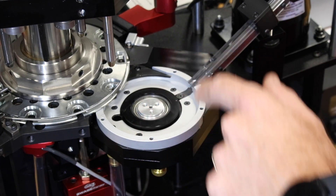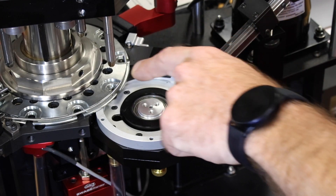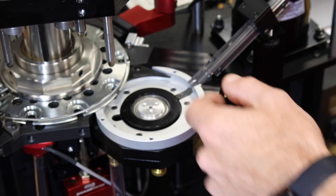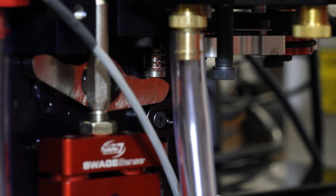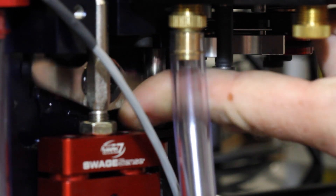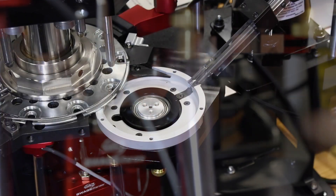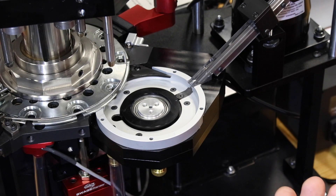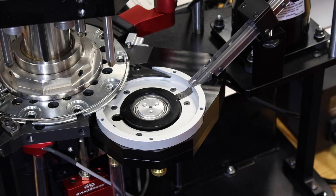Another example is you may have an obstruction — if a primer comes down sideways and gets stuck underneath the side plate, you have a couple of options. One option is to reach down underneath the priming system to the cam tire and push forward, which may allow you to push that sideways primer to the primer insertion station, then lift up with your finger on the punch itself to correct it. Alternatively, if that's not possible, you would have to remove the disc assembly, correct the malfunction, and then reassemble.